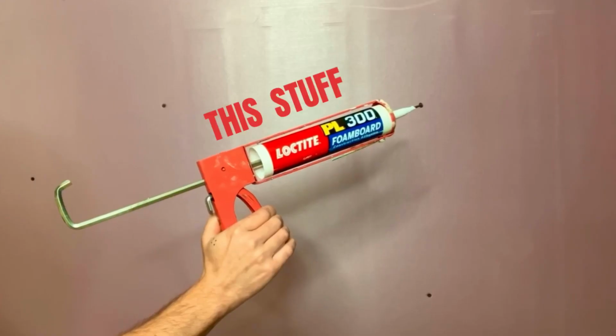I was actually able to save 3 of the big sheets for the next layer that I'm doing, so that's cool. I got 11 more of the 3/4 inch 4x8 sheets, so I think that should do it. I also got some glue that's safe to use on the foam, as well as some 1¼ inch screws that I'm going to be attaching to these furring strips on the wall, so that way the next layer is nice and tight.